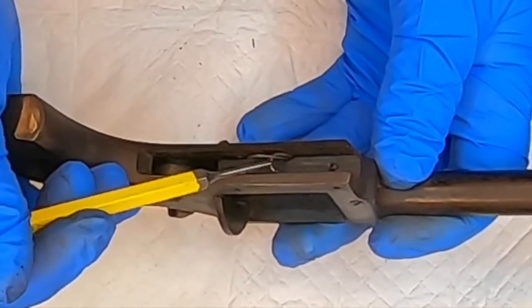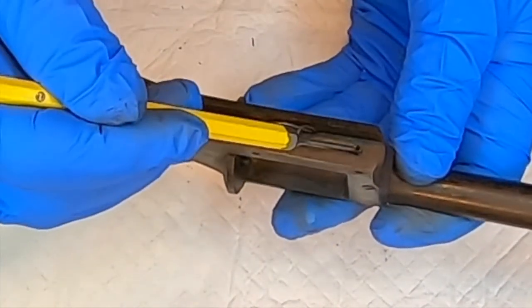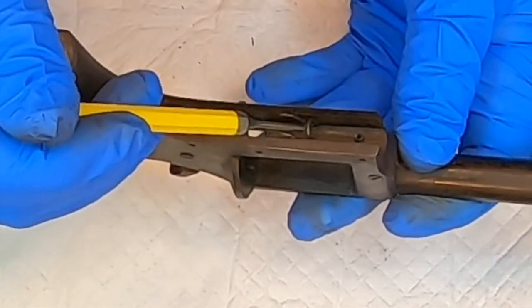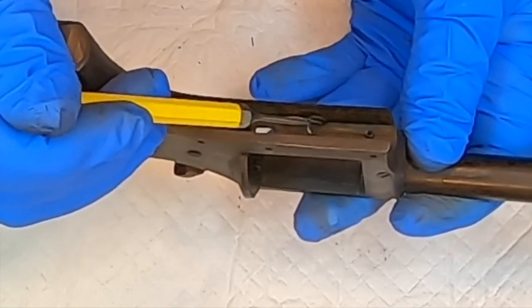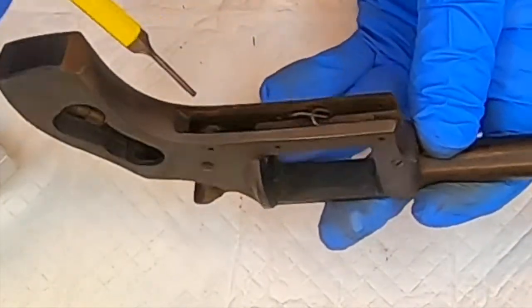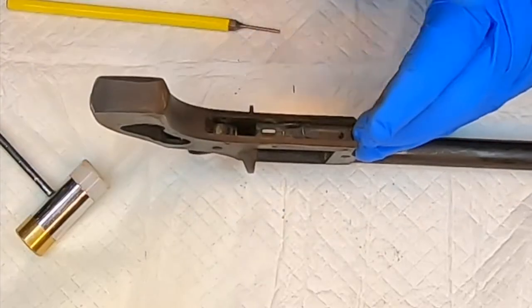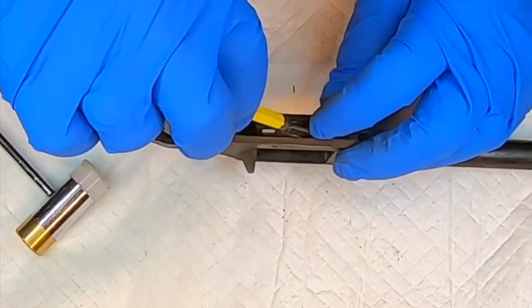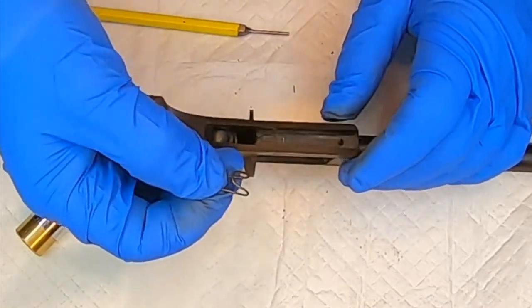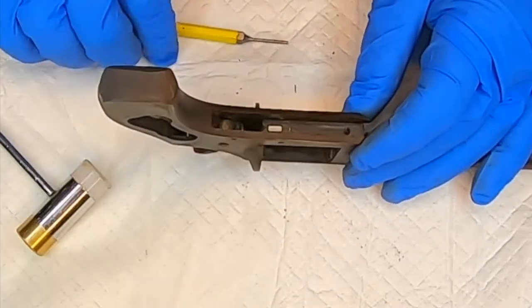Take a look at this piece in here. There's a spring — well, it's a piece of wire that's bent. The spring is here in the front of the firearm. Let's not lose this little metal piece. A lot of times they'll bend metal and put it under tension and use it as a spring. Let's get a quick picture of how that's in there and then we'll pop it out. You can see the orientation of it there.